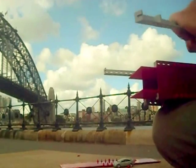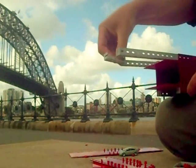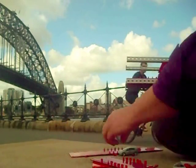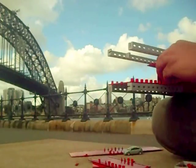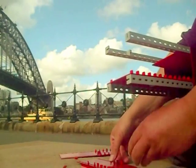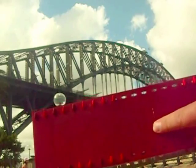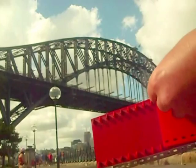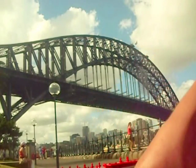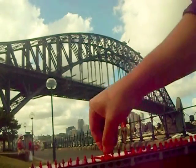Now watch magic happen. I'm now building a Sydney Harbour Bridge girder — this is what a Sydney Bridge girder looks like. This might take a little while; building the Sydney Harbour Bridge did take a little bit of a while, but this is how they did it. I need slightly longer rivets to put this extra plate on. See how the plates are doubled up at the joints. Notice where there's a joint — they put an overlapping plate, then you have longer rivets. Some of the rivets in the bridge were over a foot long because they stacked up so many plates where they needed extra strength.